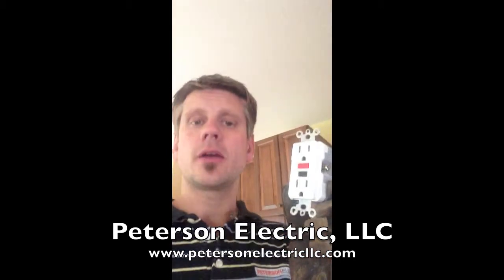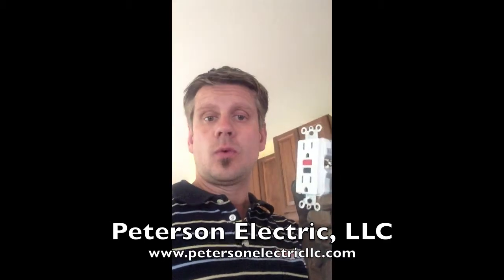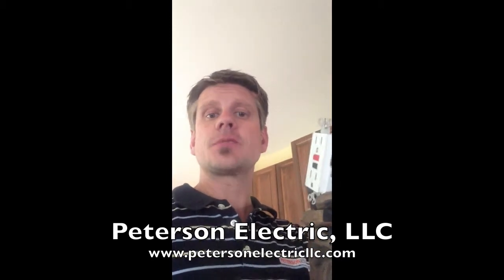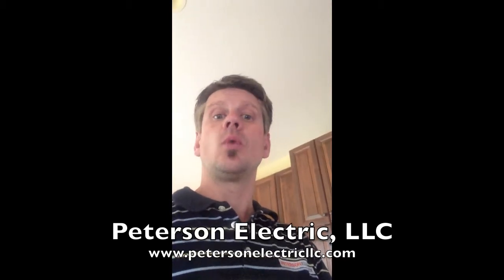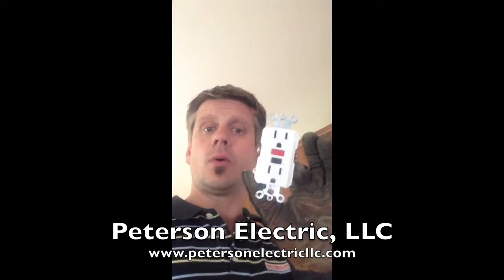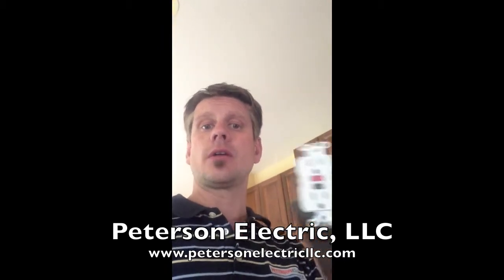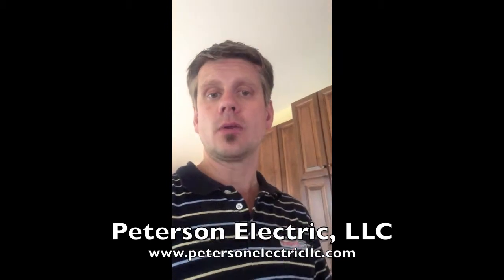It's fairly easy to wire, but if you have a bunch of wires in there, you may not want to mess with it. When you start seeing three or four blacks and three or four white commons in there, that's because you've got to know where you're feeding your load side and what's your line. You can just pigtail all of them out and put in just one receptacle and it'll kill just that opening. Or you can actually use the load side to protect a bunch of other outlets so you're not putting in $20 devices in each opening — just a normal outlet.